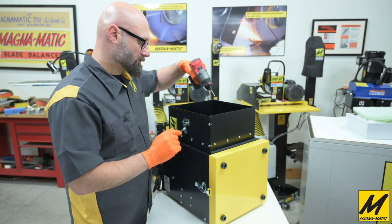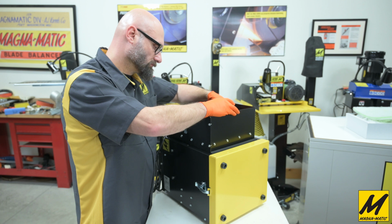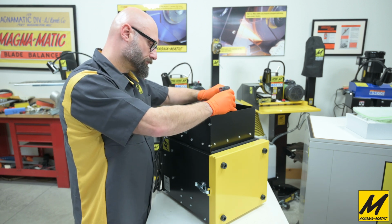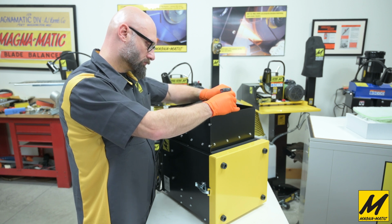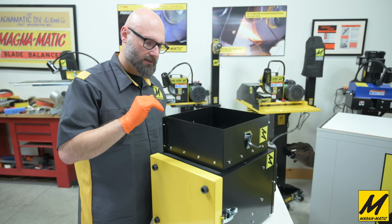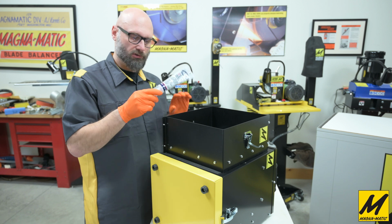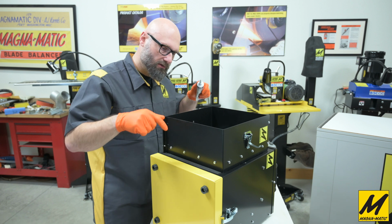Take the included drill bit with your drill and go ahead and pop that hole in. Then have your self-tapping screw. Now, while the unit is still on its back, if you need to, take a paper towel and gather up the metal chips from the drilling, and then go ahead and get your tube of caulk again, and let's caulk around the inside of the flange as well.